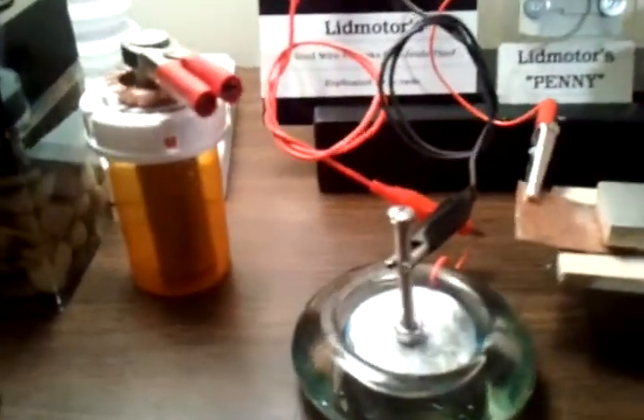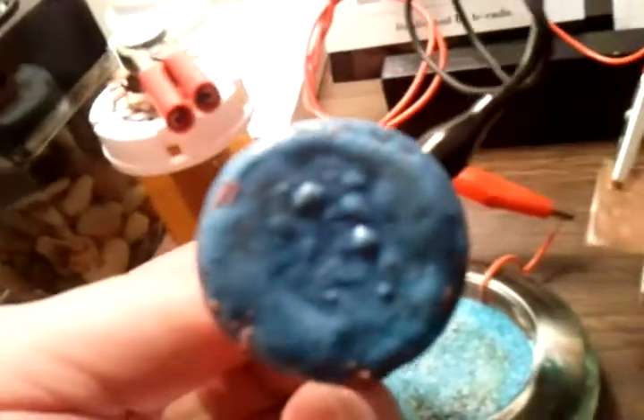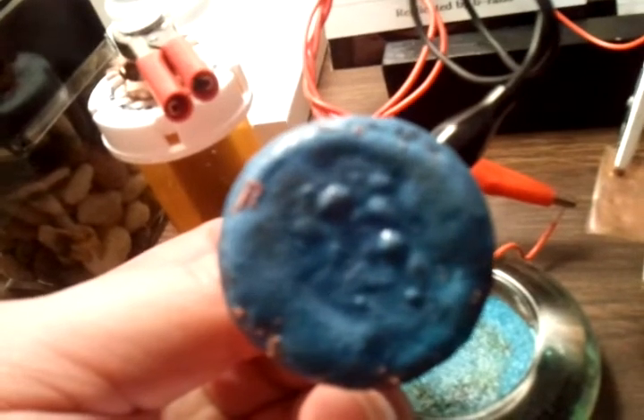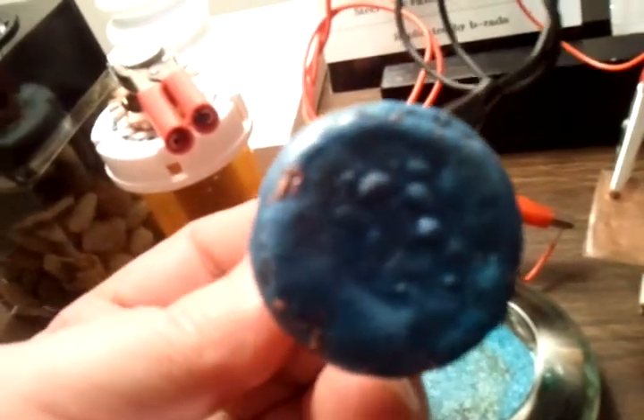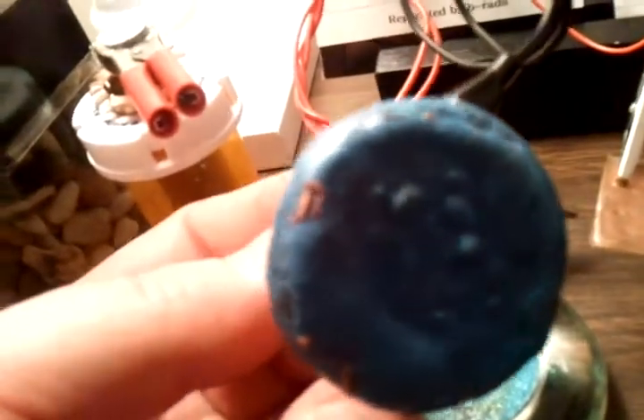So I'm going to see how long that copper sulfate will last with a lighter load. Here's another little experiment I'm working on. I've got the zinc slug, and underneath that it's just a copper plate. I've got a few crystals of copper sulfate and a piece of felt. What I've done is taken white glue and sidewalk chalk — I scraped off some sidewalk chalk into a powder, mixed it with the glue, and painted it onto the bottom of the zinc to see if I couldn't stop this black oxide that's forming on the zinc.